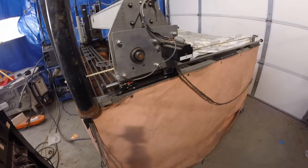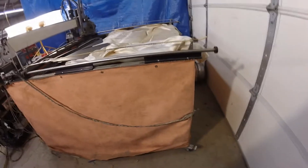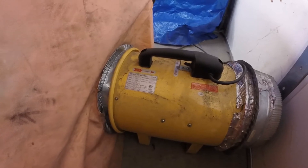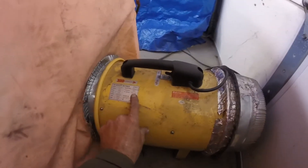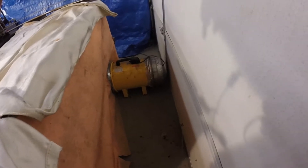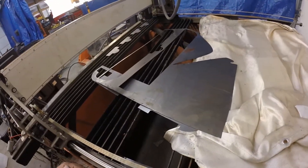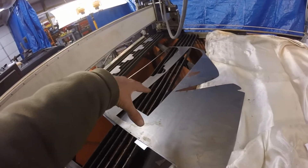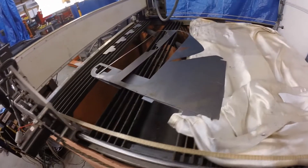The fire blanket is to keep the air confined inside. I have a blower here — it's 83 cubic meters per minute, so it provides a lot of suction. I turn that on and it blows out, and that's why it's near the garage door — I can connect a hose to it and blow it out into the yard. That creates down-draft suction, and that's why I have this blanket. When I'm cutting a small piece, I want to direct all the air through the part I'm cutting, and it works really, really well. I even had this set up in the basement of my other house and my wife wouldn't tolerate any smoke or dust coming up the stairs.